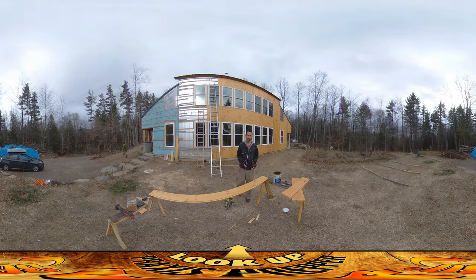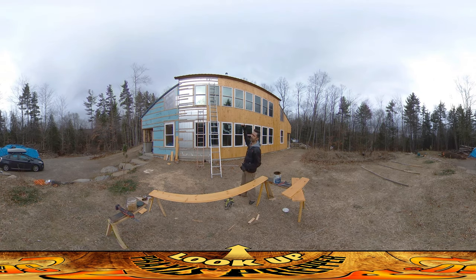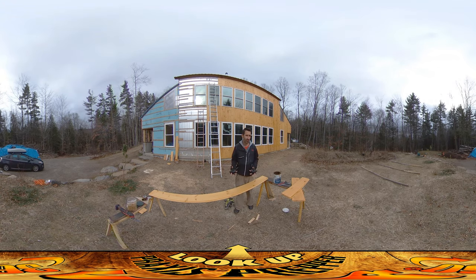I've been doing a lot of thinking before chopping boards up. The 14 foot boards have worked out really nicely with almost literally no scrap at all — I'm able to get two of the middle boards and two of the top boards. The middle boards are 42 and 3/4 inches each. The top boards have a little variability since they go up to the roof and will be covered with face board, so they can be anywhere between 41 and 42 inches. I've now run out of 14 foot boards and I'm working with 12 foot boards. On the 12 foot boards I'm able to get two of the middle or top sections at about 42 inches each, plus two bottom sections at 28 and 7/8 inches long — so by intelligently dividing up the boards I get almost no scrap.